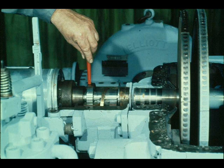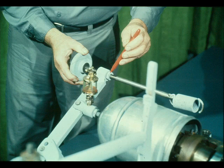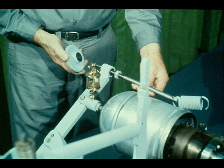This is the rotor locating bearing mentioned earlier in this module. It is designed to limit axial movement of the turbine shaft during operation. Our next step will be to measure the lateral clearance between this bearing and its fit. The workman is now measuring the clearance to be sure it is within manufacturer's specifications — this is a very important measurement. The speed changer is next to be removed. The workman removes the hand wheel without changing the position of the jam nut. After the hand wheel has been removed, it is a simple matter to slide the speed changer stem and the tension spring out of the governor lever.